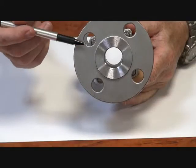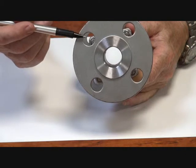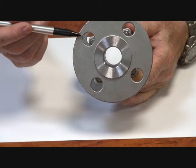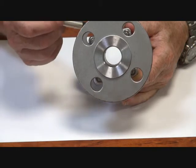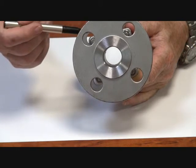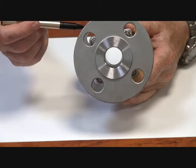There is anti-blowout flanging on the faces. The advantage of the flanged design is that you can remove the valve from the line without disturbing the pipework — the bolts just come out, you can slip it out, and then pull the valve apart to replace the seats or carry out whatever maintenance is necessary.